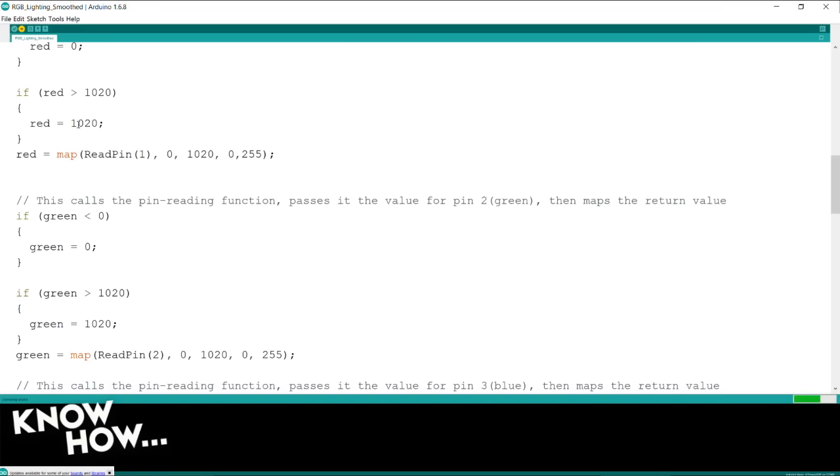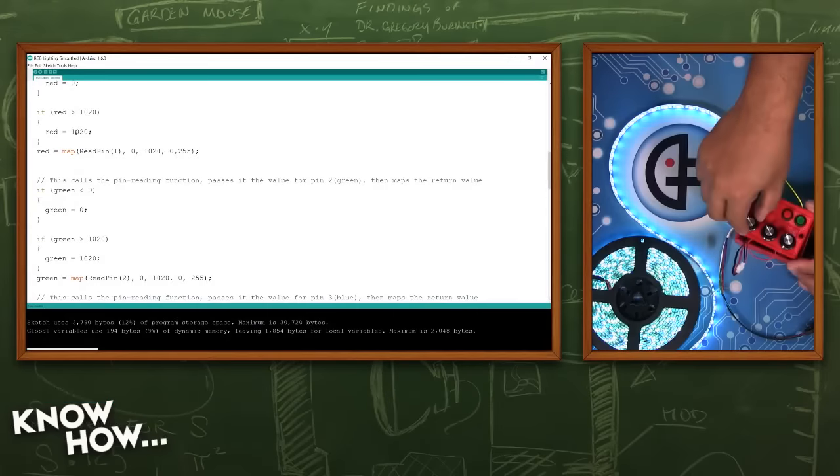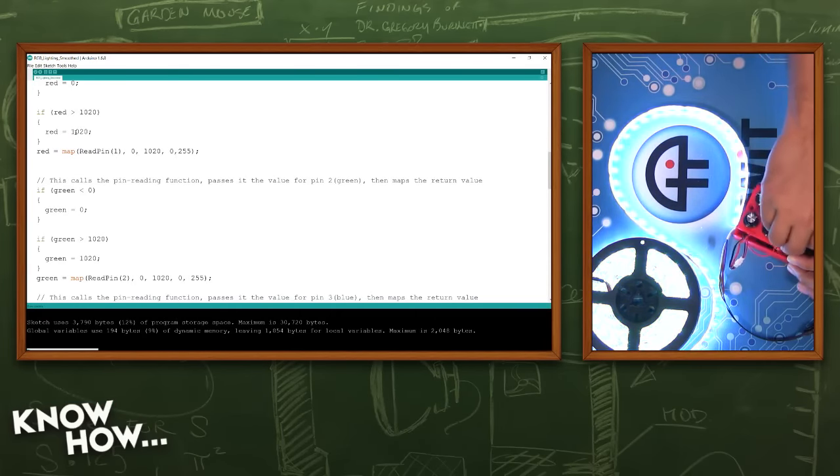And it's going to compile it and push it. So this means that every 30 reads that comes off of this is now changed to one read. Precisely. So it's the average of those 30. So now let's go full brightness. And Patrick, you can notice there's still a little bit of flicker, but it's so much smoother than it used to be. It's not intolerable anymore.